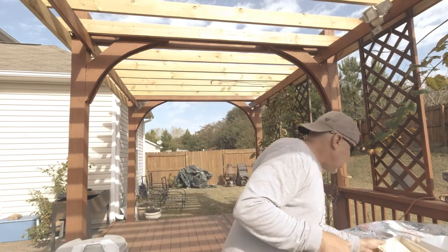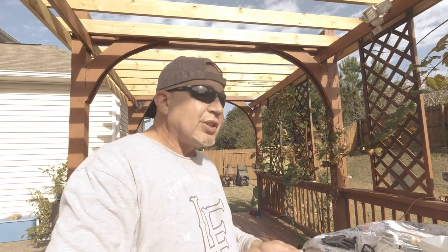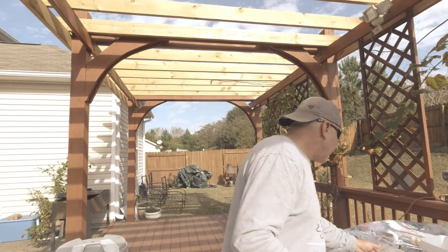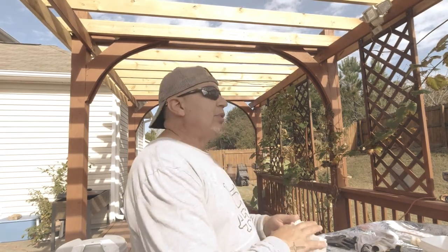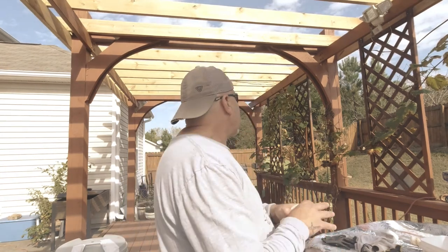But so I have my other tip here, and when you're spraying, especially with this kind of material, you've got to keep your tips clean basically all day long as you go. And if you stop for any amount of time, take the tip out of the gun, clean it, and then put it back in the gun. Otherwise you're going to get clogs and spitting and everything else. Okay. Well.